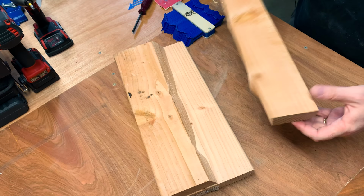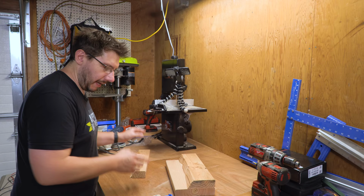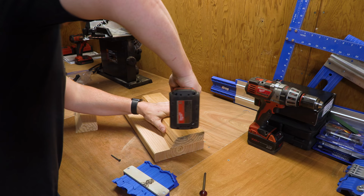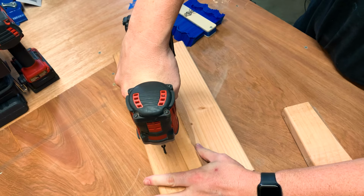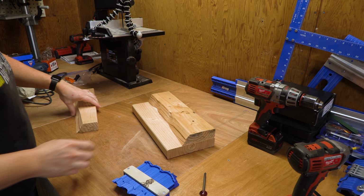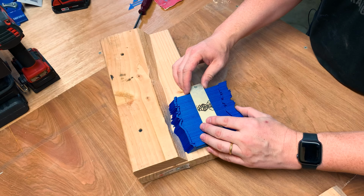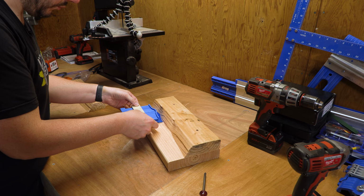We're going to flip it over, and we're gonna cut it out on the bandsaw and see if we can just get it to fit that contour. That's what we're gonna do. So first, let me find some screws. There we go. That is not gonna move, which means we can now push this against it and get the contour. What do you say we do that right there? Look at that. That's fun. Here we go. So I'm just gonna push those in to make sure they're making contact. Okay, I have no way of, oh boy, that's loose. I have no way of locking this down.